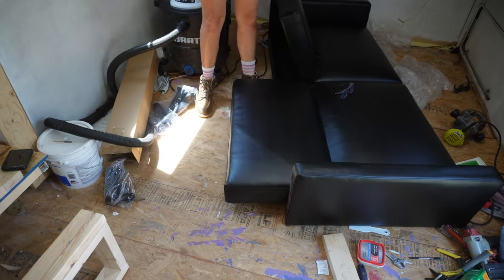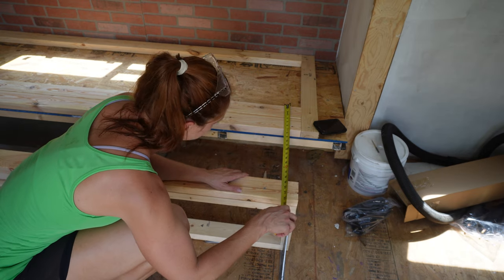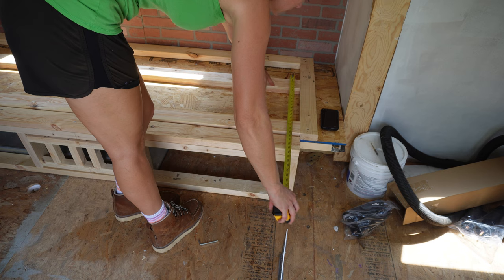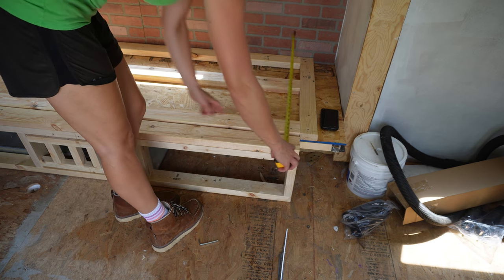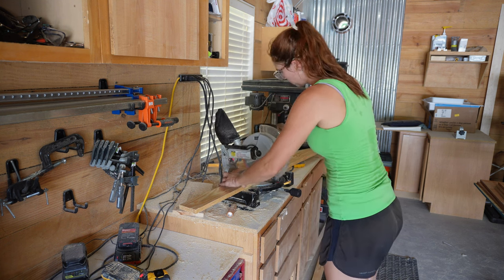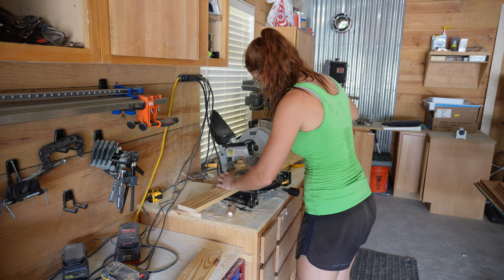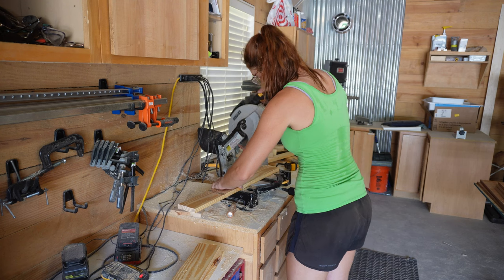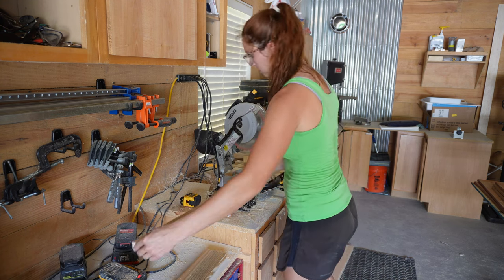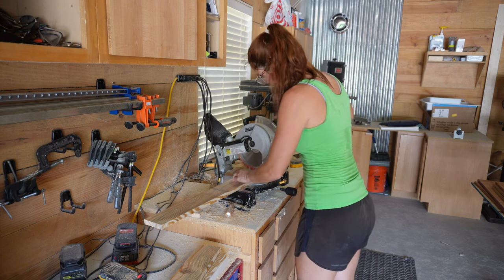The first question is how long do we need to make the slats? I got this by measuring how long the entire thing is and seeing how far the bottom piece needs to come out from the couch — it was 22 inches. So I pushed it back in, moved that piece of wood up to 22 inches, then measured from the top all the way down to the slide, which ended up being 28 and seven eighths inches. I'm going to cut a bunch of pieces at 22 inches to attach to the sliding frame on the floor, and then a bunch of pieces at 28 and seven eighths that will be my fixed stationary pieces attaching to the rectangle frame.